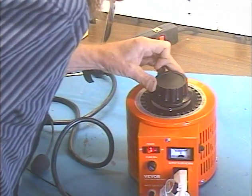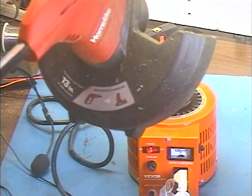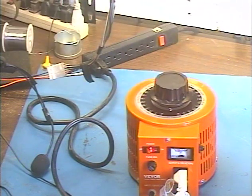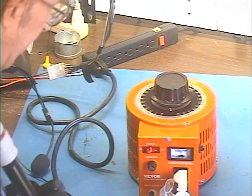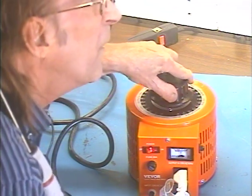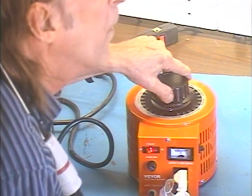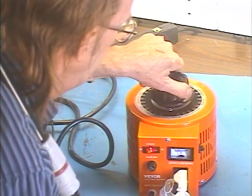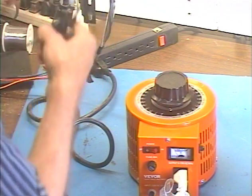Okay, I'm going to knock it down to, say, 80 volts. Let's see if I can do this without injuring myself. That's the only purpose of this video — I just wanted to demonstrate how you can save a heck of a lot of line on your weed whacker by using a Variac, which again stands for Variable AC.